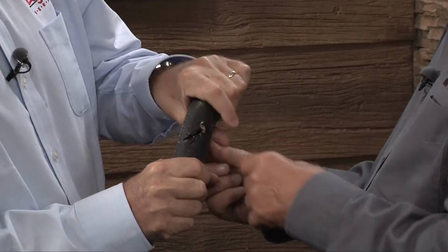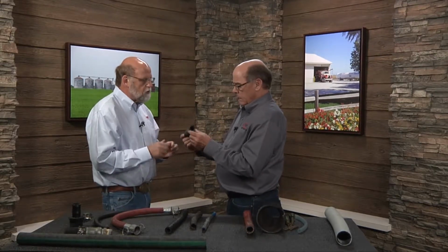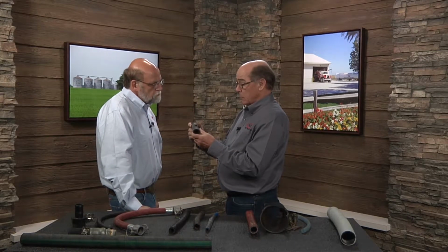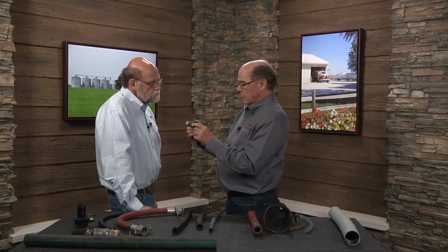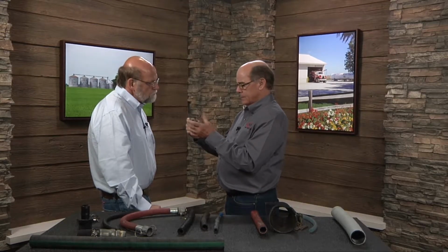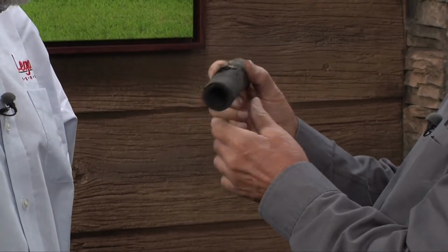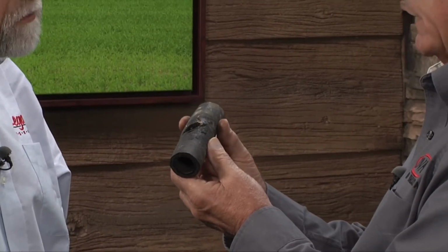This hose is an accident waiting to happen. But what's special about this hose? Just by looking at the hose itself, it's obviously a very high pressure hose, such as a hydraulic hose. It's got multiple steel braiding in it. At the pressure these type hoses run, a cut like this one is just dangerous, because anything that escapes through here, you've got to remember that hydraulic oil could be running through here at 2,000 psi.